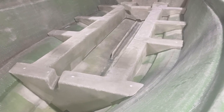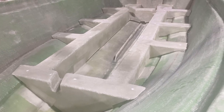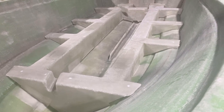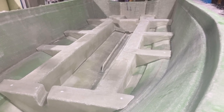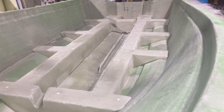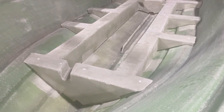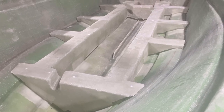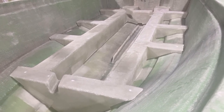We're at the next stage of the 500 Islander build process. The transom is in — the same laminate goes on the outside of the transom between the transom core and the gel coat, and then the same laminate again over the top, so it's super strong and built to last forever. We put a 35 millimeter core in.